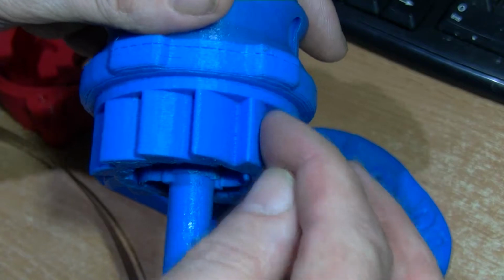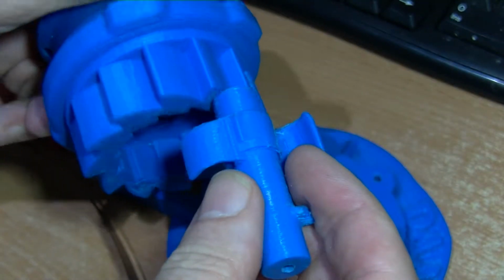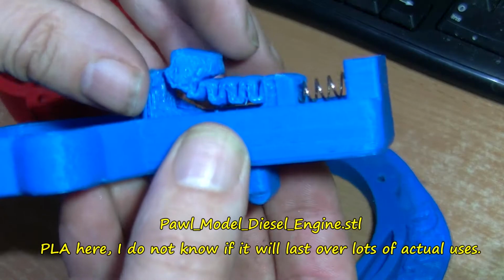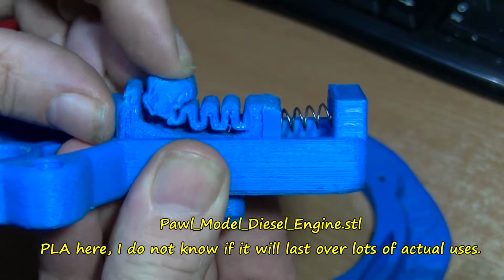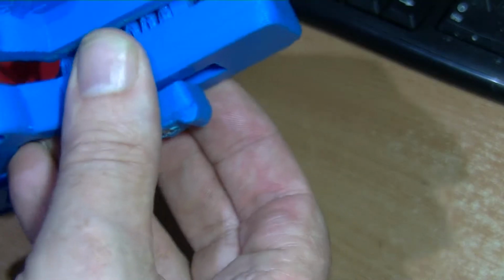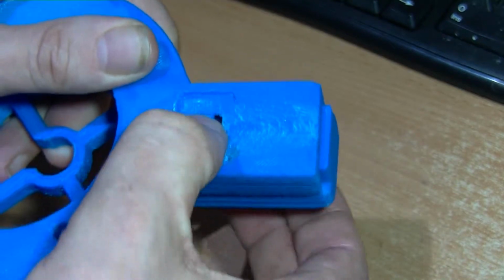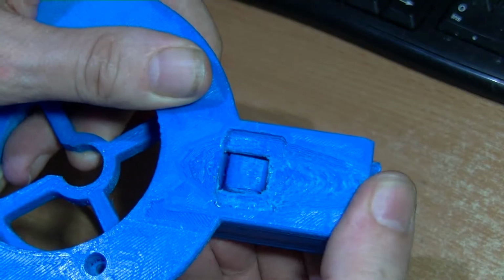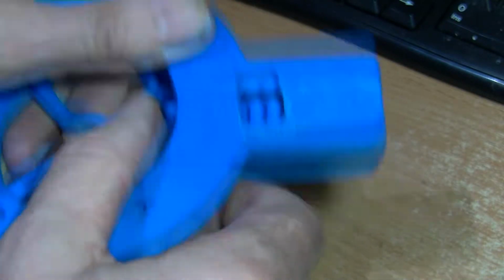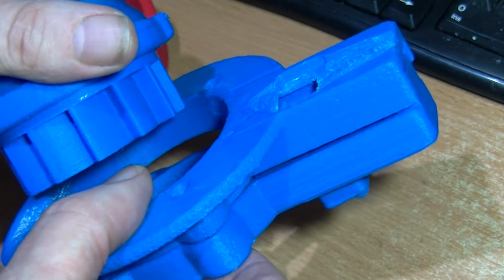I've deepened these to allow for things like that and other things, but mainly the depth there is to do with, well, I'll talk about the spring, this concertina spring here. I made this longer, so I've had to make this longer, but I've also made this whole top taller up, so that will fasten on there like that, and it works very well. That clips in there, seems to be working. I haven't given it 10,000 tries, which really it needs, and it can also move in and out when the ratchet pawl type thing here is going over it. So they're the main improvements.